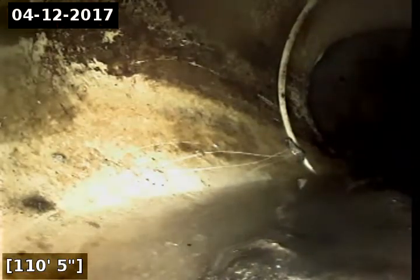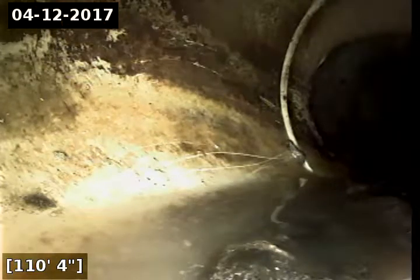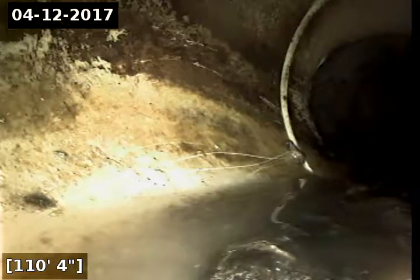There was some water under the house — we crawled underneath and found where the two dig-out spots were where they did the sewer repairs, and then one on the side of the house almost right near the crawl space entry off the driveway side — there's another area that's holding water. All that water appears to be nothing but groundwater from rain and/or irrigation runoff. We didn't see any rain gutters on the house, and so between all the rains, the slope of the property, and the way the irrigation may be either leaking or over-saturating, that's where the water is coming from.